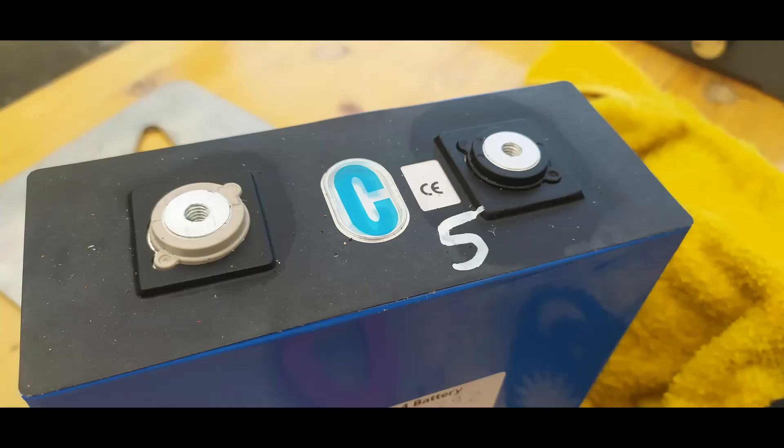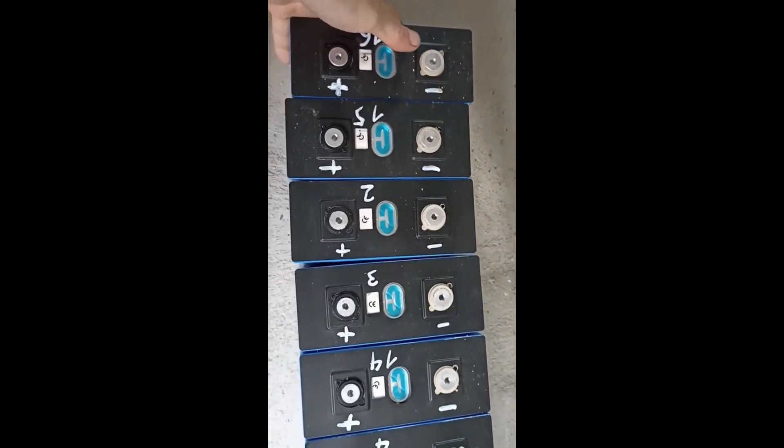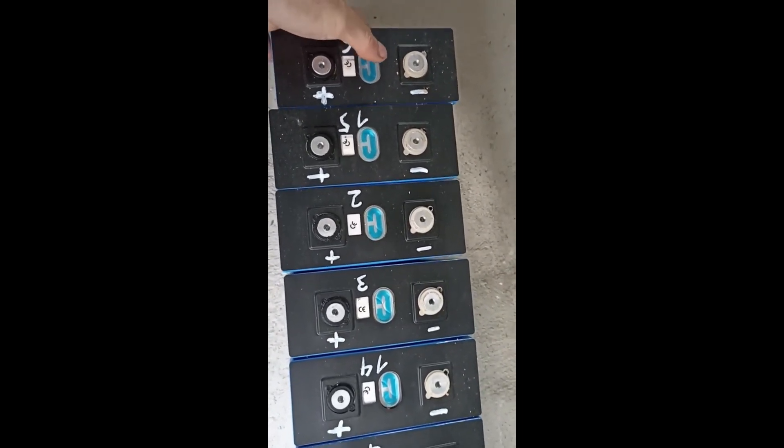Apart from these minor things, you discover moist poles and some gurgling cells. Two of them had dents. You have the choice between not being able to fit the busbars that came with them, or not having them stand evenly on the bottom surface because of their shape.